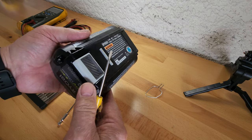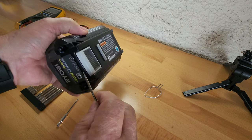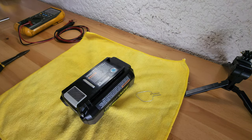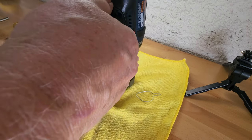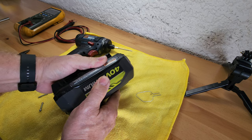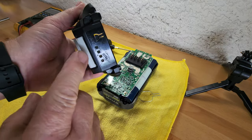You would be voiding your warranty, but this is already out of warranty, or at least probably close to it. Underneath this cover you can see it's just glued down with a stick-on, so this is actually glued here and here. Some people cut it with a razor blade; I didn't have to. The four screws come out, this comes apart like that, and you've got this sticky decal right here and then it comes right off. That's all there is to that.